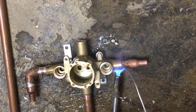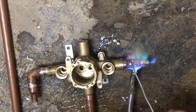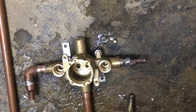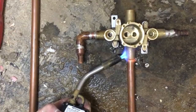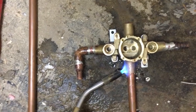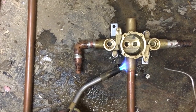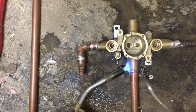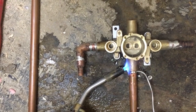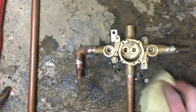You may have to heat up the brass a little bit longer than the copper, using the exact same solder that you use for all the copper fittings. It doesn't take very long to heat them up and apply the solder using the map gas. Any drips you want to clean up — you don't want any drips because that may compromise the integrity of your solder at the joint. This is real-time; we wanted to give the impression that it may take you a little bit longer to solder copper to brass. Make sure you dab off any excess solder to get a nice, clean look.